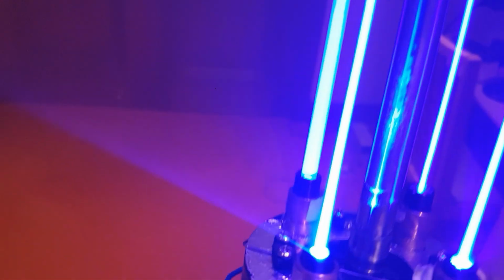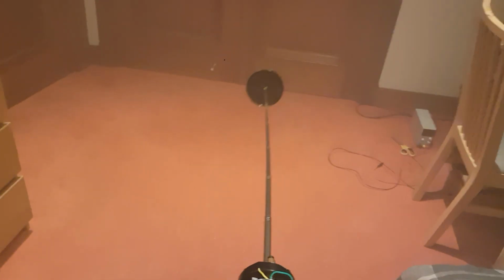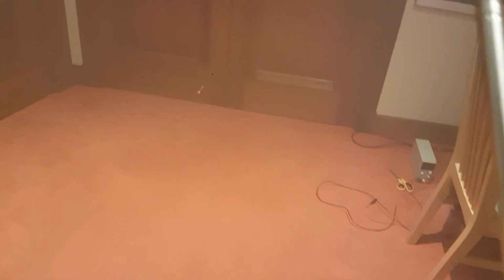Also, because of the imperfect lenses and rapidly diverging diodes, the lasers spew out tons of laser light on the side, hence why I used the relatively large backstop. But the disadvantage of using a large backstop is that the telescopic pointer bends, enough even to let the lasers shine outside of the backstop.